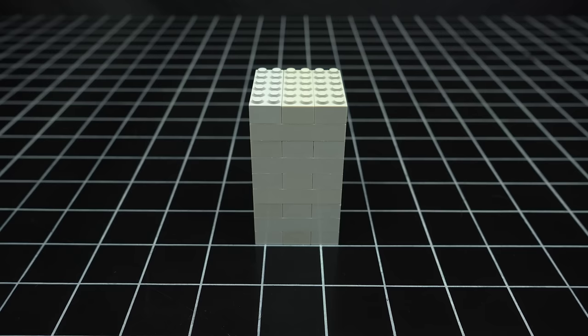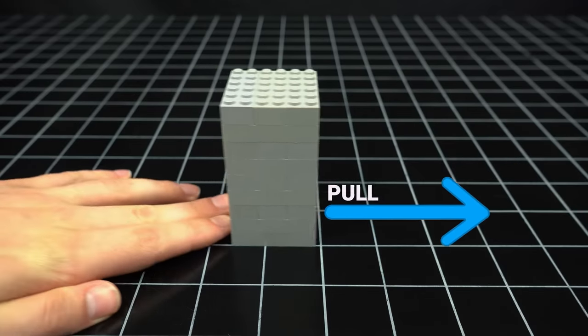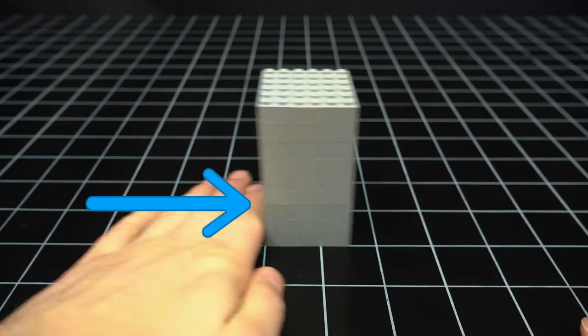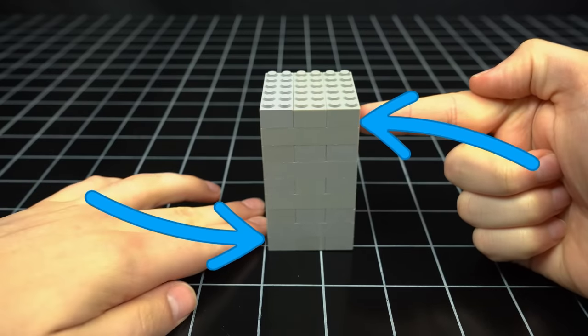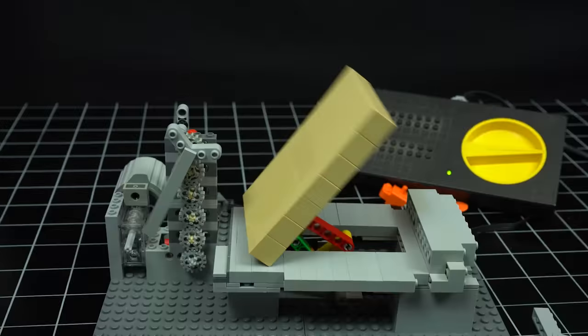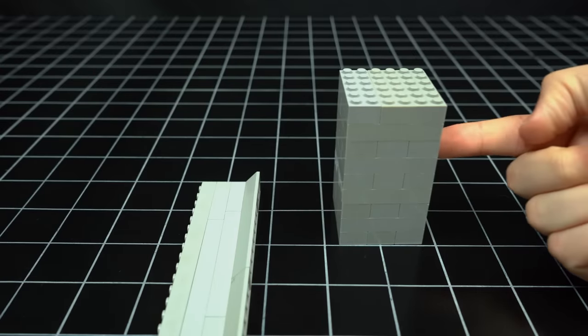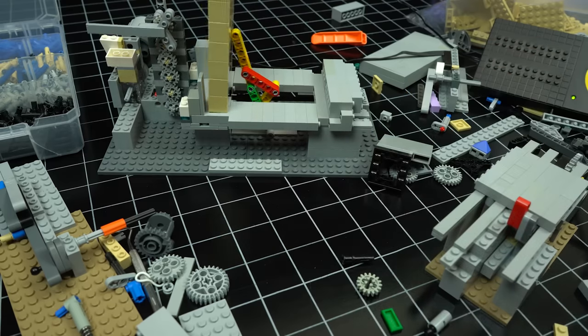You can see the exact moment of the betrayal. Imagine this as the domino: the magnets will pull the domino back to the center from both sides, and the lift arm pushes near the top right of the domino. Individually, none of these make the domino fall, but when the lift arm is pushing and the magnets pull, it causes the domino to rotate and fall over. To fix this, I'm going to add a wall stopping the domino from going to the left so that it never needs to be pushed back in.